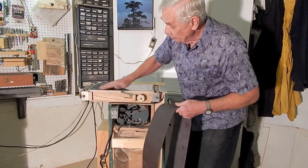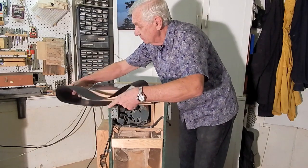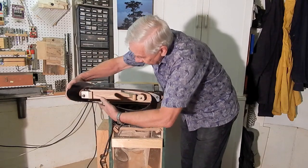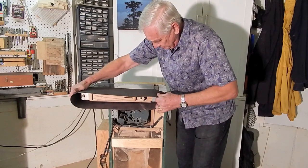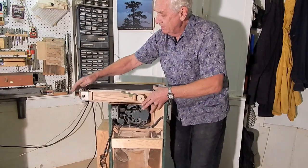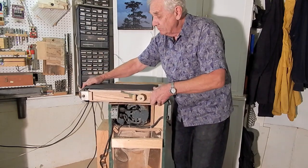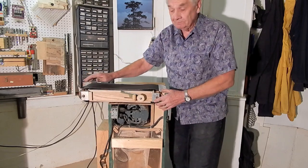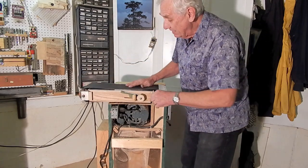If I release the tension, the belt is easily removed. The whole belt sander module is cantilevered onto the cabinet, so there's no obstruction to removing the belt when the tension is released. To do this, I couldn't find small enough pillow blocks that would permit me to slide the belt over them, so I made up pillow blocks with aluminum blocks and brass bushings. They just need a couple of drops of oil a couple of times a year — they last surprisingly well.